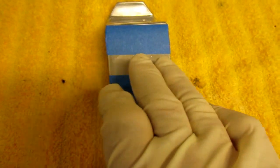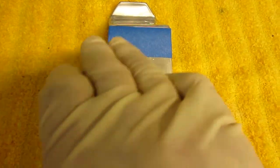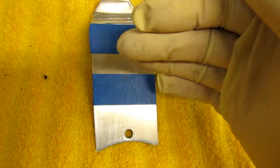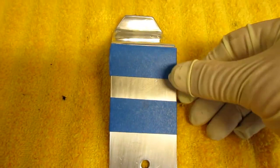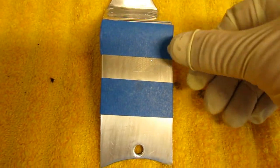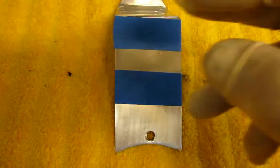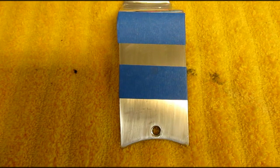When you want to buff something out, if you don't get it flat to begin with, the final thing is going to have mountains in it. So get it flat sanded, and then each grade of polishing you do gets out the scratches from the grade before. If you watch them do truck wheels, they do 180, then they go to 320, then to 600, then 2000, and then they start with compound, a rough compound, medium compound, and final compound. Then usually at the end of it, they'll put some protection on, carnauba wax or Flitz. But this is basic 101 polishing. I think by the end of this day, we will have learned something.